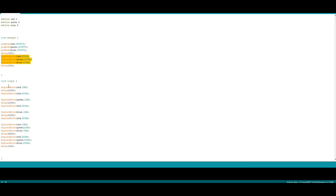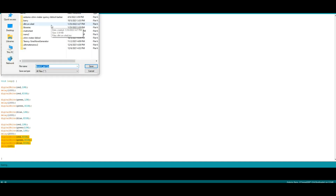And that's the end of our setup. Now we have the actual program. The first thing we're going to do is turn pin 3 — the red pin — low; that will turn on the red lights for a second, then it'll shut it off. Then we'll do the same with green — somebody cut and pasted and forgot to make some corrections — and then with blue. And finally, down here we'll do white, turning them all on for two seconds, and then we'll turn them all off.